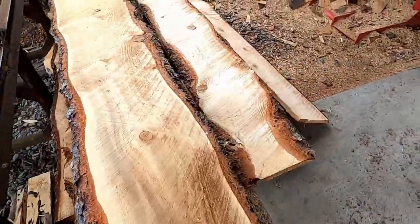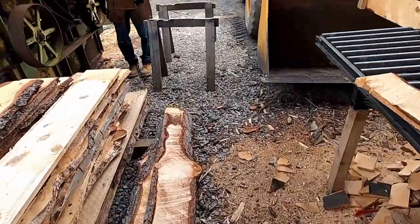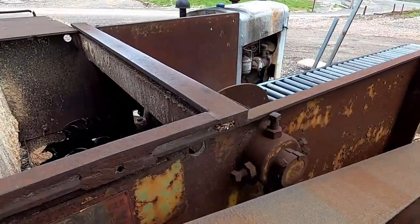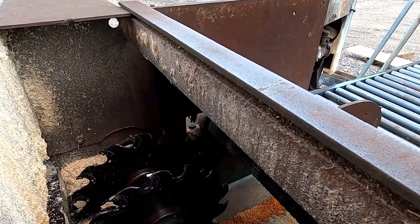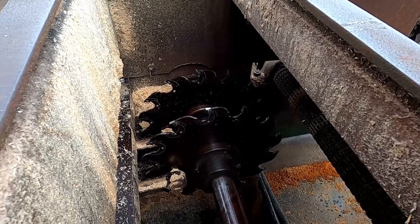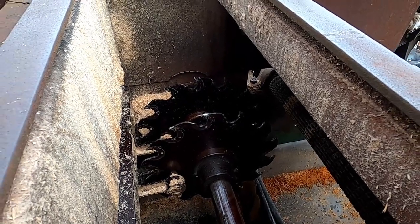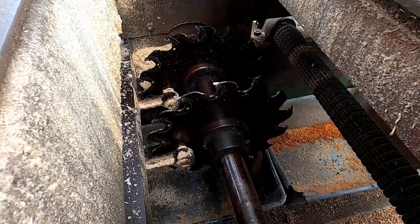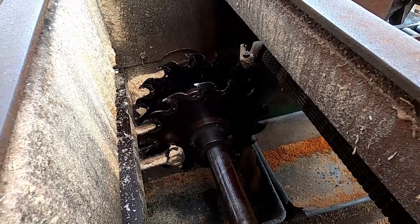So the business end of the edger, and there's Eddie Horvath getting ready to roll here. Inside of here, there's two blades. You want to shift them, Ed? We can show them here, and you'll see the saw furthest away from me will stay stationary. And there you go. That's how you do your width of your board.